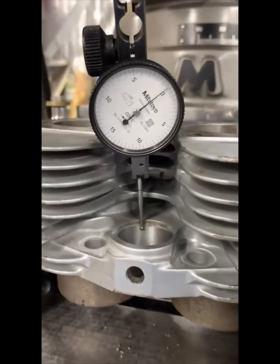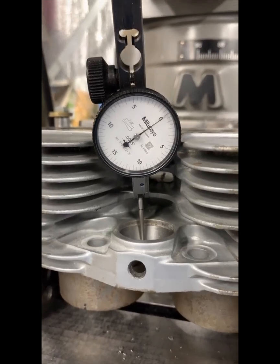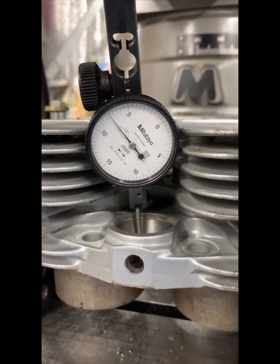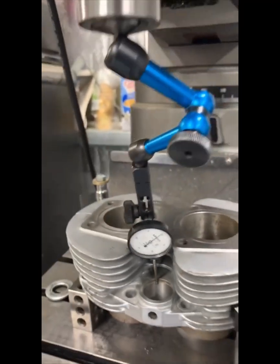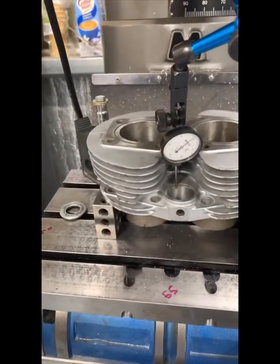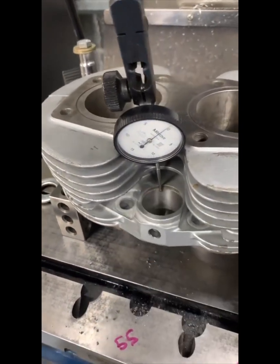So the barrel is nice and tight. Let's drop the needle down to make sure we're at zero. We're good — it's still 3.5 degrees, accurate and good. So what we'll do is pick up the center of that hole and then start doing the machine work on the top.